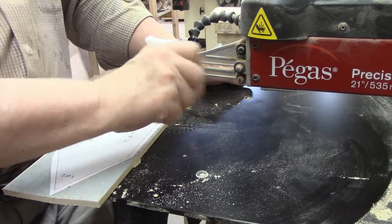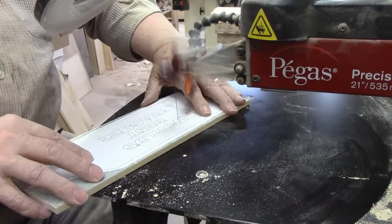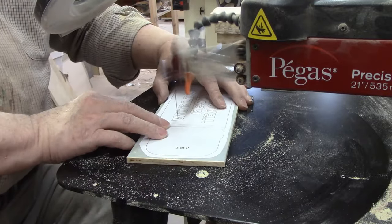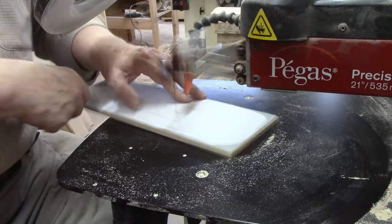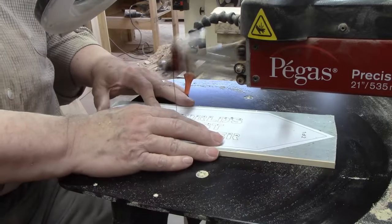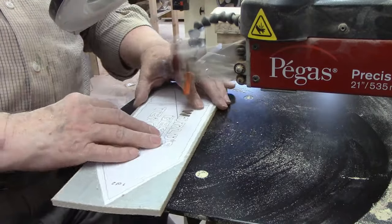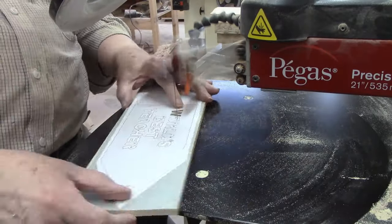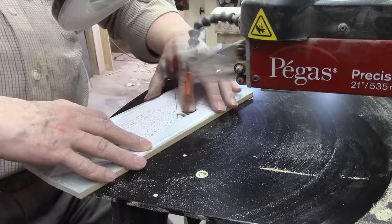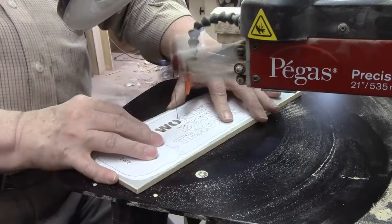Usually I do the interior cuts first and I think that's what I'll do here. It doesn't matter what order you cut the letters in, but I usually work the way you read them — starting at the top left, then going left to right. The same rules apply to making turns as before, but I do one thing differently when cutting letters: rather than cut on the line, I try to cut so the blade is just touching the inside of the line. Letters are generally spaced close together, and if you aren't careful you can end up with the cutouts from two letters touching each other — an overlap like that will look bad at best and ruin a project at worst. The skills for cutting letters are essentially the same as for making intricate interior cuts.